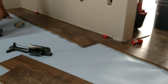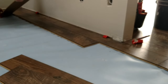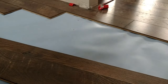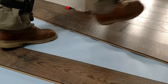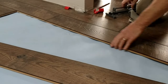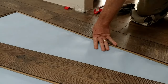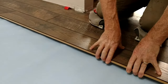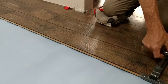I use the whatever-it-takes approach to getting the first couple of rows together. I usually have to use my shunting tool backwards at first because it doesn't fit the conventional way. Once I get away from the wall, I can turn around and pull the planks to me. It's also easier to tilt the plank from that angle to get the edge started. When you tip in the end joint, keep your plank as close as possible to the previous row. Then your plank won't have as far to travel home. The greatest point of friction is where the joints are locked in.